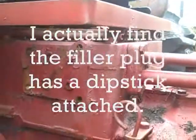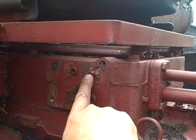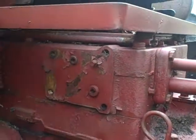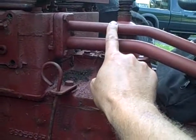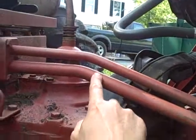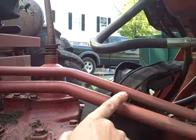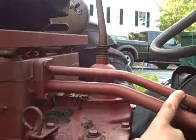Looking on the side here I can see a plug here and a plug here, and also a little plug here. These two lines are the lines that run over to the hydraulic pump — the hydraulic pump is run off the motor so we have live hydraulics all the time. One line is thicker than the other: this larger line is going to be your suction line, fluid traveling to the pump, and the smaller line is going to be the pressure line, pressurized fluid coming back.